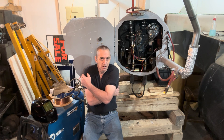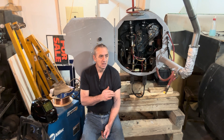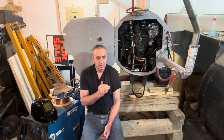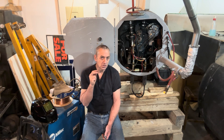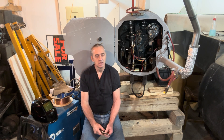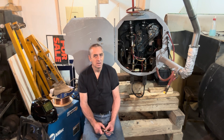I am planning on a dehumidifier system in there. I have a couple of ideas of how I'm going to do that. When the submarine is parked and not in use, it's going to be sealed and I'll pull a vacuum on the hull. I have an electrical connection going through the hull so I can plug in an AC-powered dehumidifier to keep the humidity out. Maybe that's all I need. I could even have a dehumidifier running off the batteries with a solar panel or a windmill on it for when it's parked in the water. Any suggestions are welcome — I'm really not a big expert on condensation and controlling it.